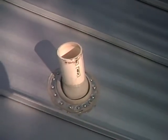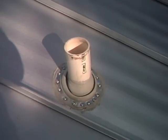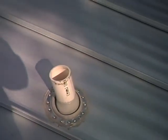Here's a detail for where we came to a seam and pipe. I'm going to paint the pipes and put square boots on here. I have some round boots, but the round boot pulls in and the square boot gives you a little more access, so I'd suggest putting square boots where you have seams. Here's an example of where I had my large pipe come out — came out pretty good, I was really happy with that.